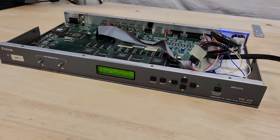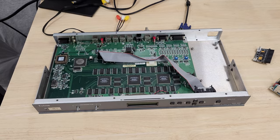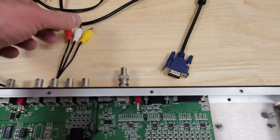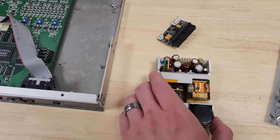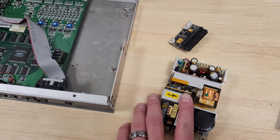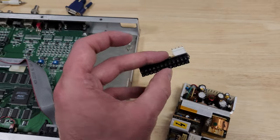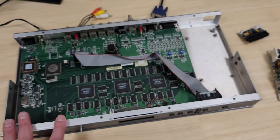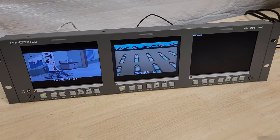Oh my god, it worked! Yes, look at that - it really was just the power supply. All right folks, we're back on this Extron scan converter repair. If you didn't see the last video, this thing can take VGA in and turn it into composite, component, or S-Video out. The original power supply inside had gone bad - we diagnosed that in the last video - and I'm going to replace it with a Pico PSU ATX power supply. Parts came in, and I really want to get this thing buttoned up and in the rack. I've got plans to make the home lab rack look like a miniature TV station. Let's get into it.